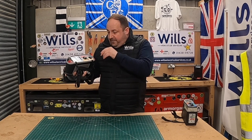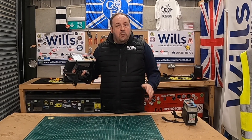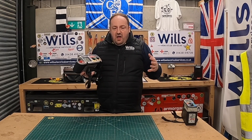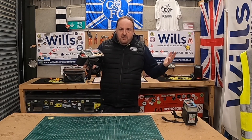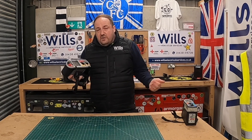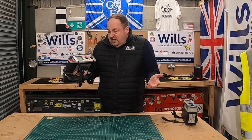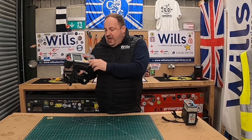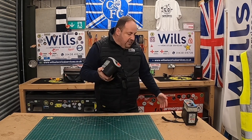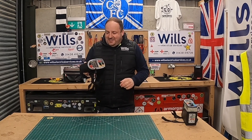The brown dial positions are to do with the earth electrode testing - I'll hold my hands up, that's probably my weakest point. I was chatting to Paul from E5 on a live video and he was going to do some earth electrode testing - I've asked if I can come along and have a look because I've virtually done none of it. If we have anywhere with an earth electrode, I just do the R1+R2s and loops and record it in the limitations. There's also an earth leakage meter attachment, though I was speaking to Lee Baker about that, and since I've already got so many I just do a separate video for that.